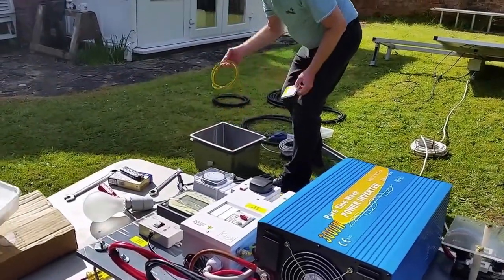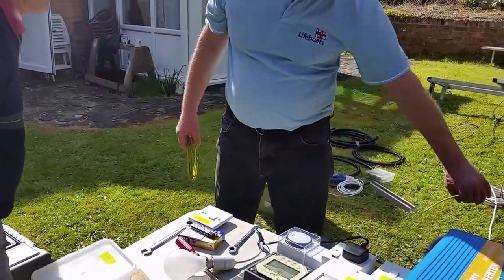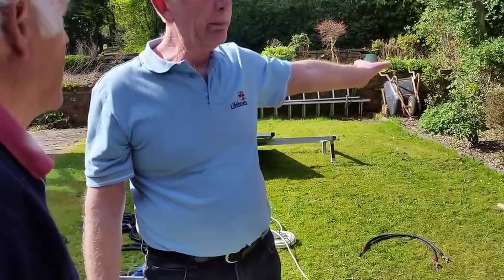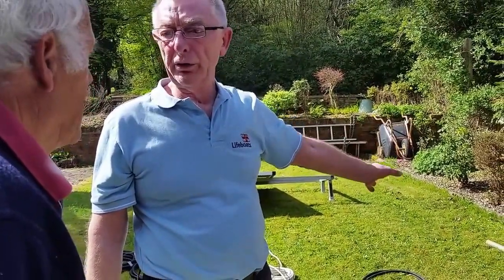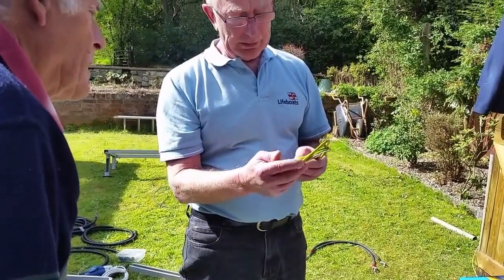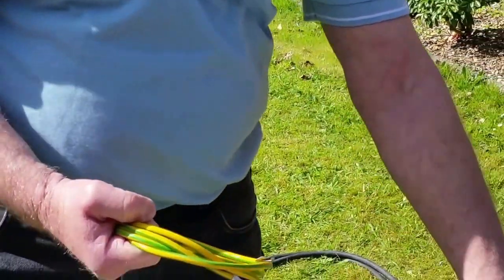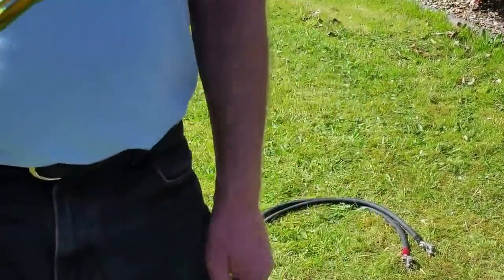We're going to change this in a minute. I've got you a spare earth cable. You may want to run this long one from this unit into the nunnery or the school and collect their earth, so you know that you've got a good earth. Or you can go straight from the earth rod into that. That's safe. That's 4 mil, is it? No, I think I've used 10 on this. This is 6 and this is 10. That's a big meaty earth cable. So you can connect here to your earth with that, or not use it. At least it's in the box.